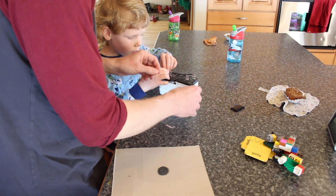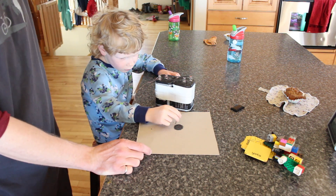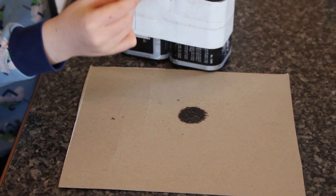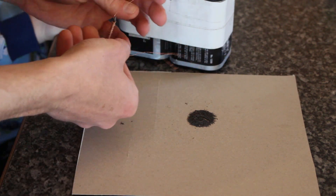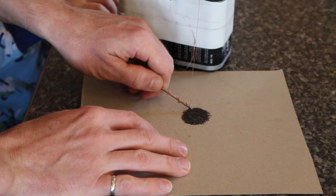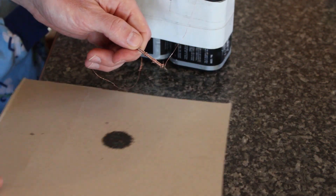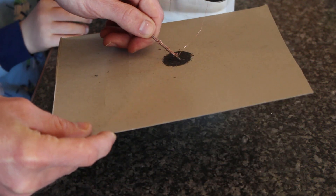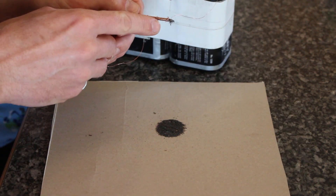For this you'll probably want to use a nine-volt battery instead of the AA battery that you have. But if you wrap that wire around a nail and connect it to a battery, you've now made a magnet. You'll be able to do all the same things with it that you can do with a normal magnet — you can try picking up paper clips, try bringing another magnet close to it and see if it pushes or pulls. And you can put it under a sheet of paper and sprinkle iron filings on it to see the magnetic field of your electromagnet.